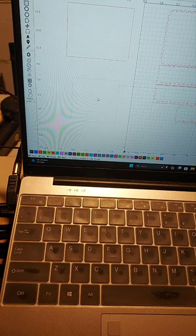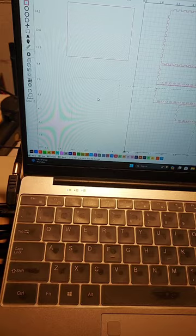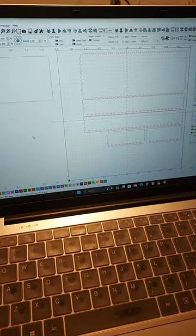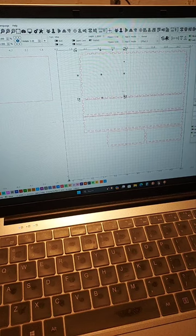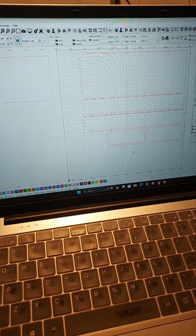Here's what I want to do with this - I want to use it as a border marker. I've seen on some other lasers that you can actually turn the laser on as a light to run across and make sure you're on the surface. Either my type of laser doesn't do that or I just haven't learned how yet. So here's my little hack: I'm going to put the square just barely outside the edge of my cutting area. I'm locked on size so let me redo that - just barely outside where I want to be cutting.